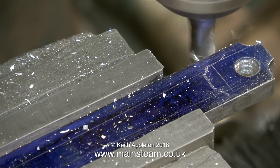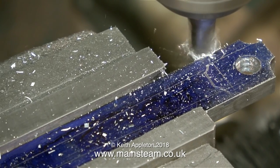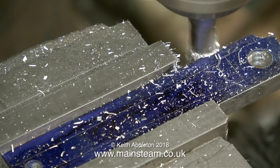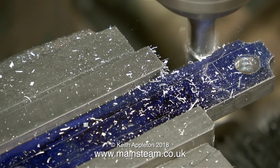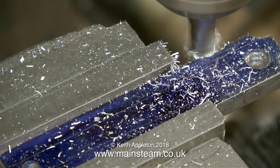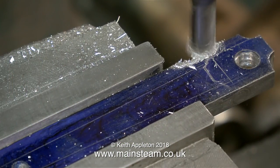If I was just milling the edge of a rod, I could use the cutter full length. But the minute I come into the work, it starts to scream. However, as you can see and hear, provided I don't push the milling cutter into the work, I can use the side of the end mill at full depth, and it doesn't make much noise — it just removes the metal. It's cutting beautifully at the moment and not making much noise at all.